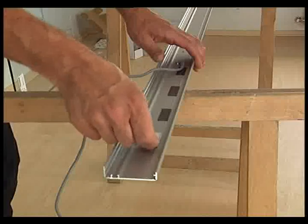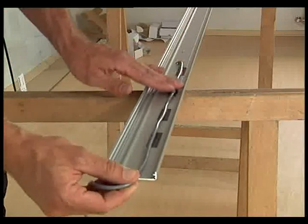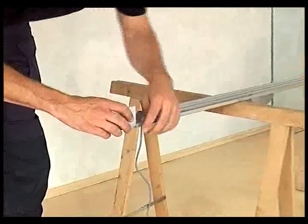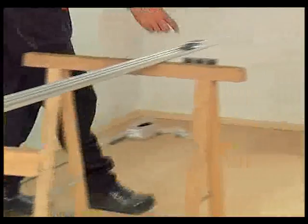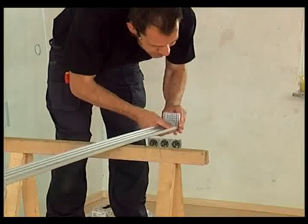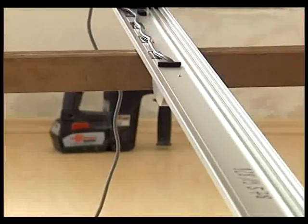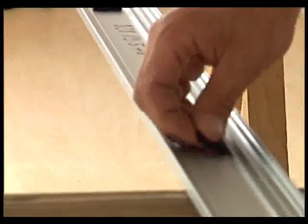Adhere the cable to the back of the cover with double-faced adhesive tape and ensure it is positioned straight and points towards the side of the control unit. Following the mounting of the infrared motion detectors, you can fit the end caps into both ends of the cover. Now, fix the enclosed self-adhesive pieces of foam rubber equally onto the inside of the operator cover.